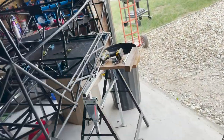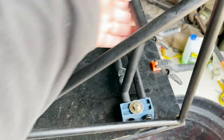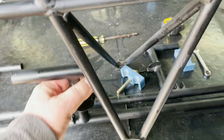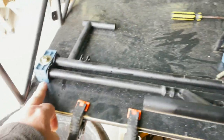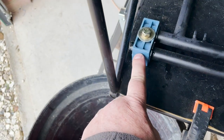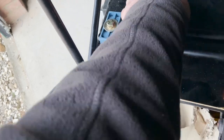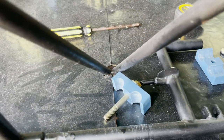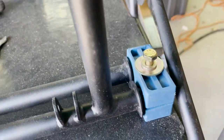Back to this boring job — flat wheeling out these bushings. A lot looser, but I've only fastened one in at the moment. That one's a bit stiffer. These have to return to neutral on the return spring, so I've marked which is the front because the front one is a bit tighter. The back one seems loose enough, so a bit more work on the front and then the other bushings.